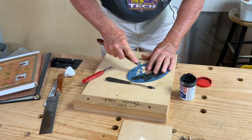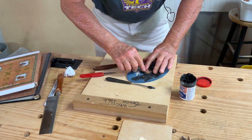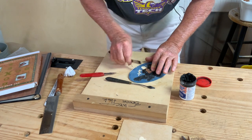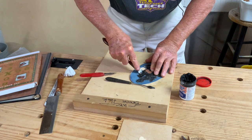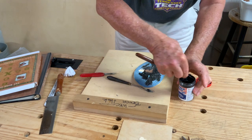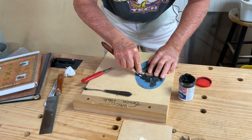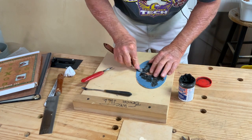I save all my ebony dust — I've got it in a tin. If you make something out of ebony, it's a problem because the ebony dust gets into white wood and you've got white ebony. It's a mess. It's better to put a coat of shellac on it before you start messing with sanding the ebony. All this stuff I know you're supposed to do, but I get impatient when I get to that point.